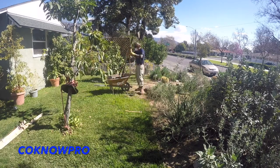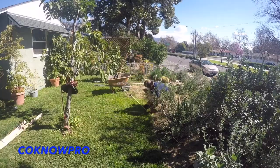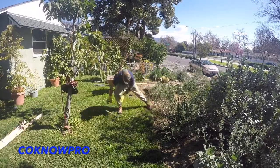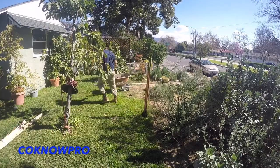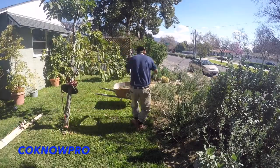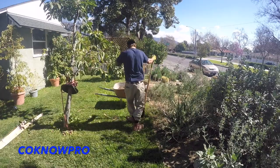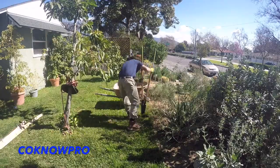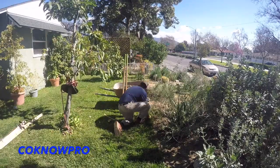My dog ear fence planks are 6 feet, but after you cut off the dog ear, they're more like 5.5. So I mark my posts and set them every 5 feet. That way my dog ear fence plank can land half in the middle, basically center of each post. Once your layout's done, you use your post hole digger, set your post, and you're good.